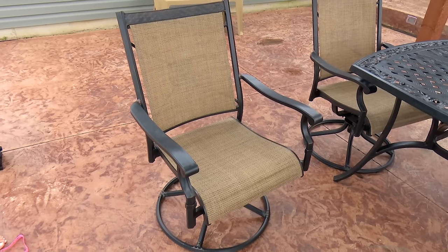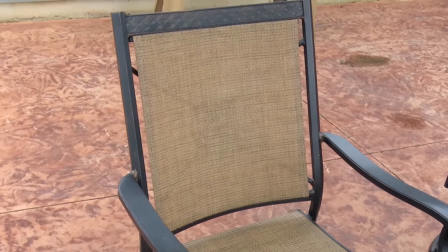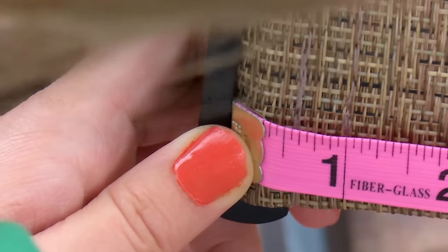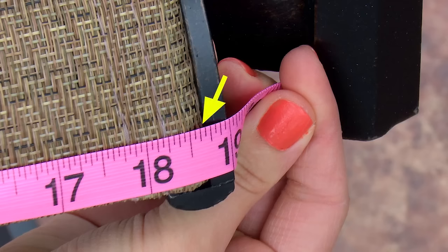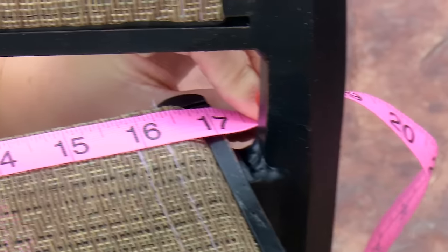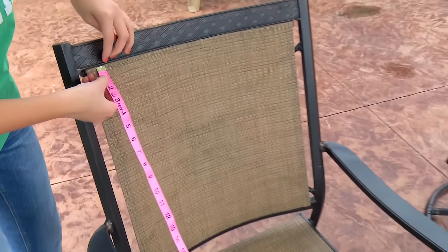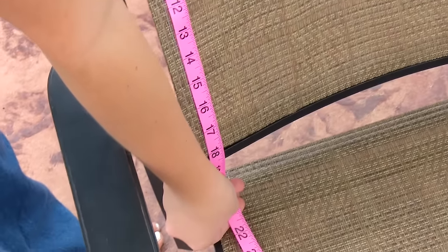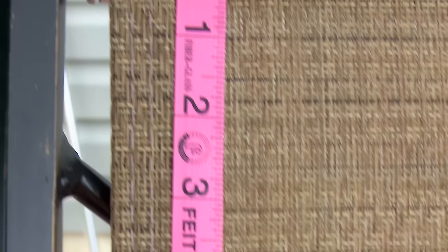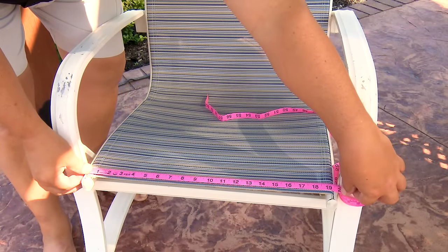This patio sling chair is slightly different. The seat portion is not a perfect rectangle — it is actually smaller in the rear. Also take a look at the back rest panel: it does not have sling rails on the sides but on the bottom and the top edges. It is measured in the same manner from sling rail channel to sling rail channel, but it is also important to measure and write down the opposite end's size as you will want to duplicate the shape when making the new panel. Your chair's configurations may be different, but the principles are the same for all types of patio sling chairs.